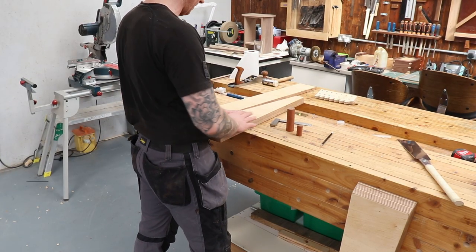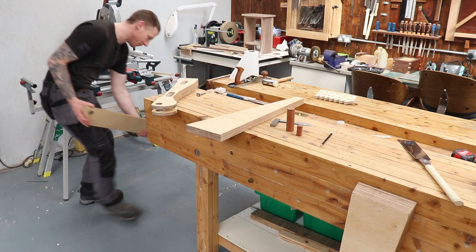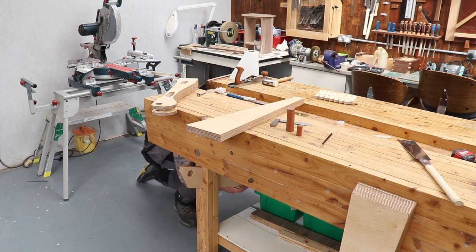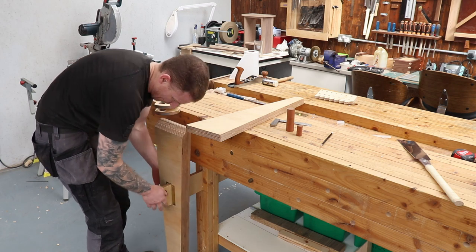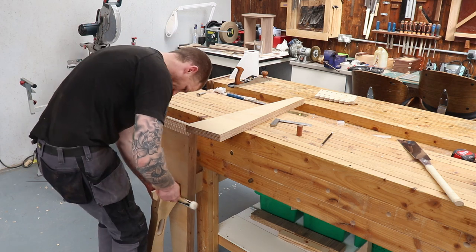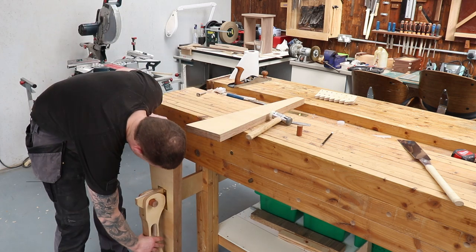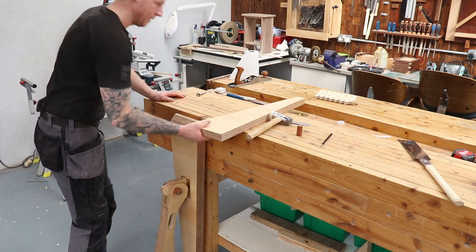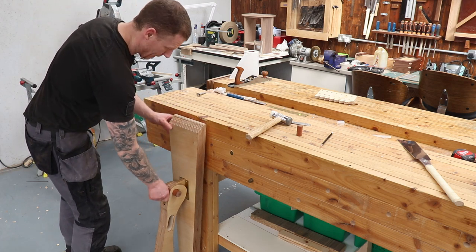All our pieces and pins are made, sanded up, and finished with boiled linseed oil like we did on the last video. Time to assemble. Our new tenon board has to go in first, slid through from this end. That's our new sapele pin in place - nice and stiff, just what we want. This is our floor wedge which will sit like that. Nice and simple. Now we need to reinstall our mechanism.